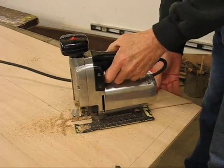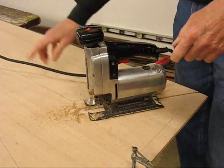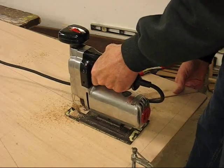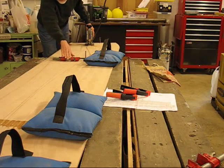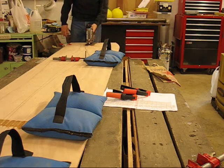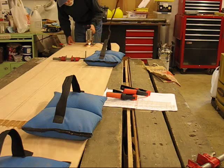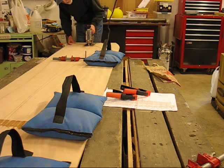I'll work it around — I'm lined up a little back. That was the other thing I talked about before: having gaps in it, you can cut in between. I put this pipe clamp here in line where one of the vertical 2x6s is on the A-frame underneath the sawhorse part so I don't cut through it. I also tweaked up the speed on this. Again, stay away from the line and we'll come back to it with the hand plane or a rasp, depending on where it's at.